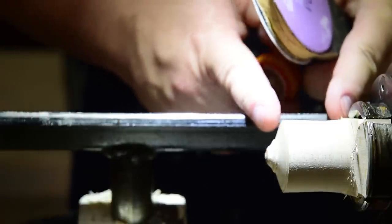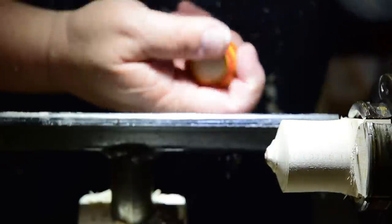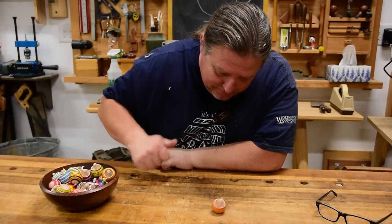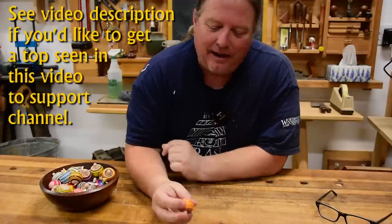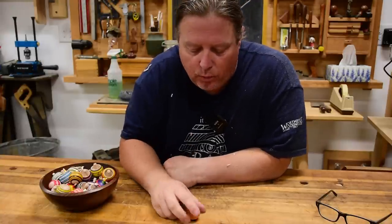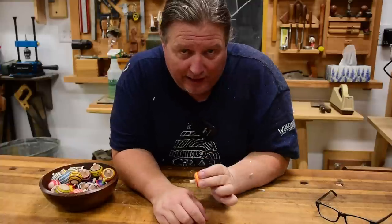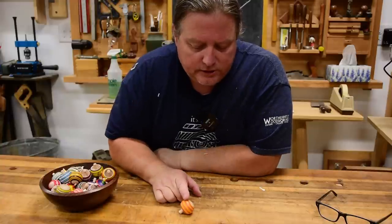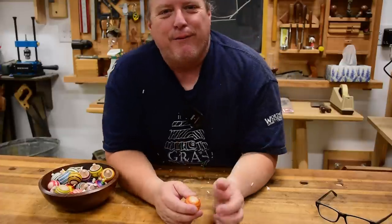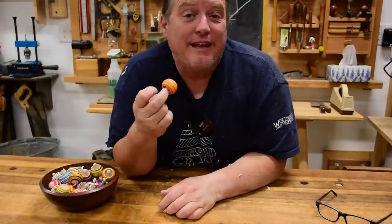If you need to, you can flatten the tip out a little bit with sandpaper — you don't always have to. And that's not enough space for me to make another tippy top, so I'll make a normal top out of that remaining section. The last step is to test it out and make sure it works. I did notice that one of my standard tests is laying it on its side — it should right itself up. On this particular one, I probably either hollowed too far or didn't have the handle quite long enough. I hope you enjoyed this video and learned a few tips or tricks — maybe something you can make as an impulse buy or to entertain your nieces and nephews. Is it real magic or is it Newton?